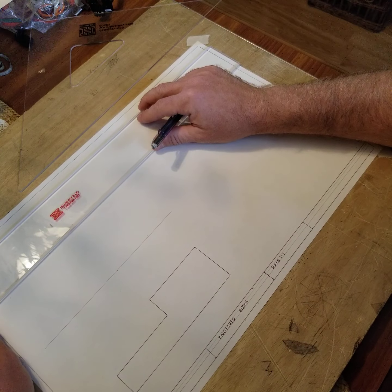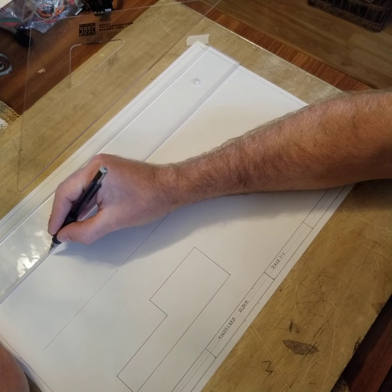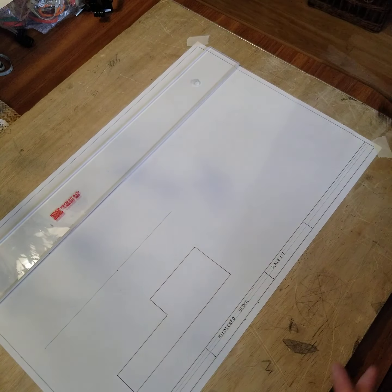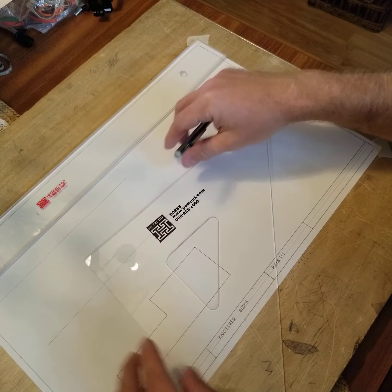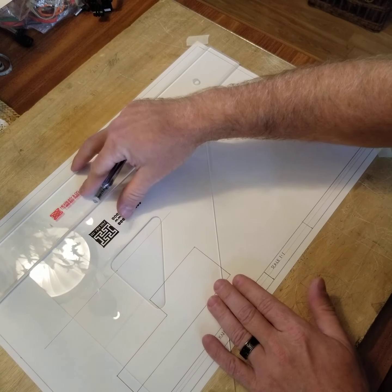Line up. Do the same thing. Make a line that's a little bit longer. Okay, so I'm setting the angle of my pencil. I'm going to drag. Okay, cool. Now this is the cool part. This is called projection. I'm going to project these outside edges into this view and create what's called a bounding box. Okay, so I'm going to pull and push.